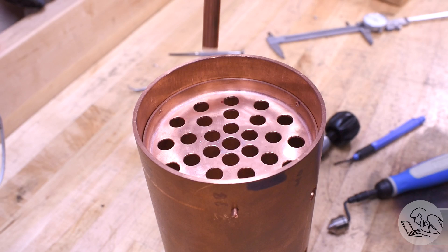Here's the story so far. I've got my two tube plates done - one on the top that has two extra holes for the steam valves, and then one below with matching holes everywhere else. So now we need 26 fire tubes to give us the sweet, sweet surface area that gives the evaporative power to the boiler.